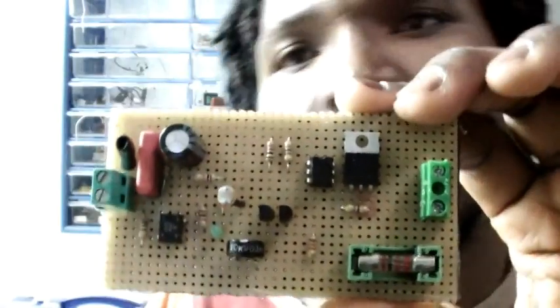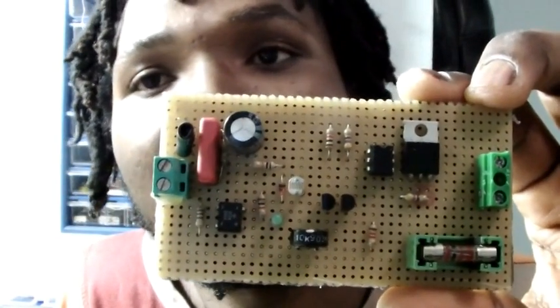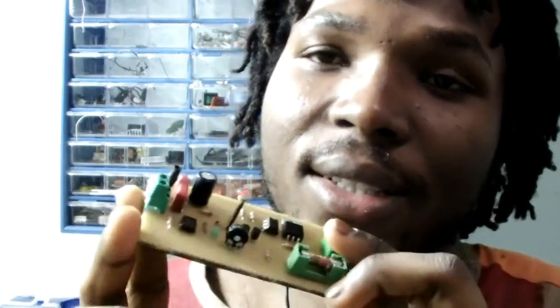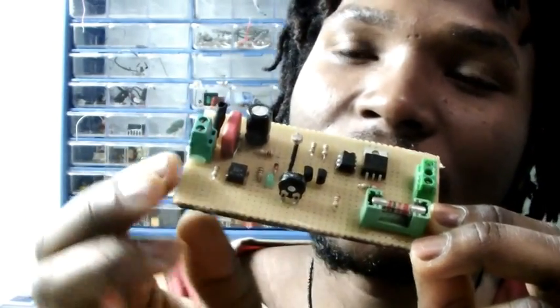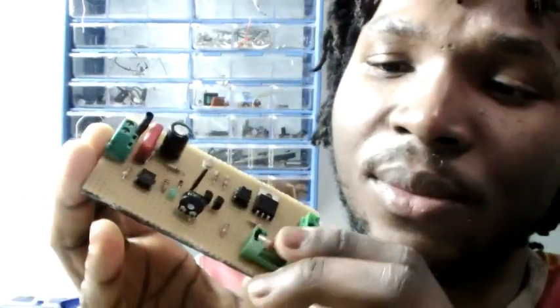This circuit is useful for garden lighting — when it's night the light goes on, and in daytime the light goes off. You can also use it for security purposes: it only switches on when it's dark. It's also useful for saving power because sometimes you forget to switch off lights and they can stay on during the day for even a week. This circuit makes sure that doesn't happen. You can also adjust the 10K variable resistor for sensitivity to darkness.